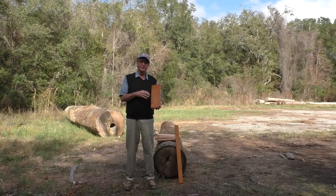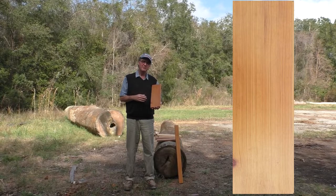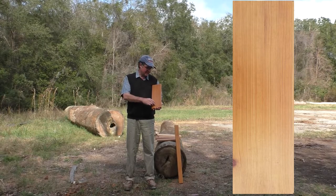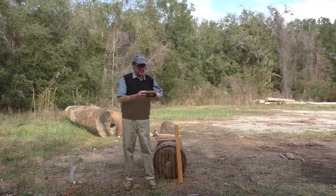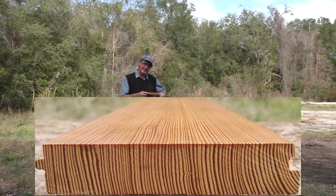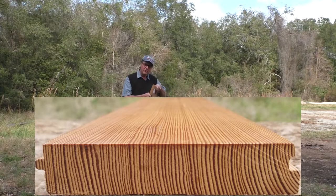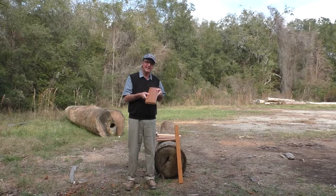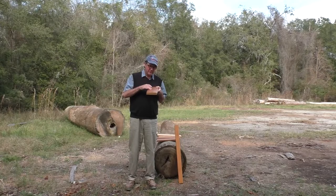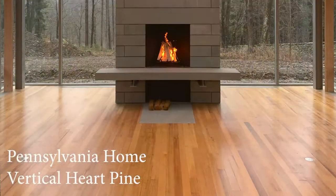This next piece of wood is what we refer to as vertical grain or quarter-sawn grain. Lots of people have heard quarter sawn before — it's identifiable by this pin-striping grain pattern on the face, all of these multiple parallel lines. If you look at the end grain, you'll note that none of the growth rings falls below 45 degrees, and that's the trick in quarter sawing. A lot more labor goes into quarter sawing, a lot more manipulation of the log as it's being sawn. Scientifically, quarter-sawn wood moves less than plain-sawn wood, and historically you'll find quarter sawing in door surrounds and window surrounds in historic and vintage homes, because you don't want a lot of movement in your doors and windows.